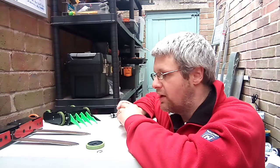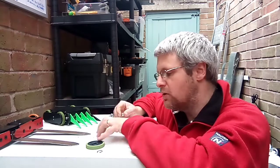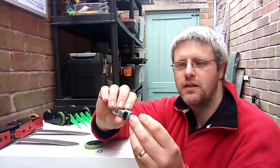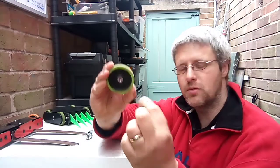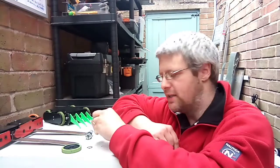However, the first event we went to with Claws 2 — this is pre-BoggleBots — after the first fight, one of the wheels wasn't working. The motor was spinning but it wasn't turning the wheel. When you order these, you have to order the wheel hubs separately. The hubs fit on your motor and you tighten the grub screw over the flat spot. The wheel fits on the hexagon and you clip it to hold it all in place. The clip's fine, the wheel's fine — it's that grub screw. They are essentially too small and the friction just isn't there.